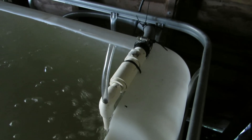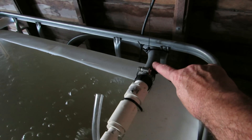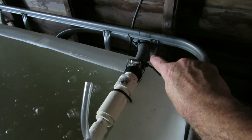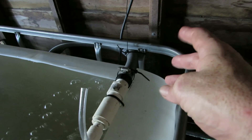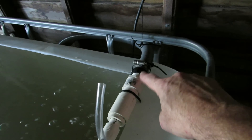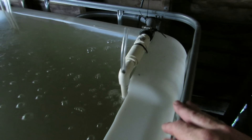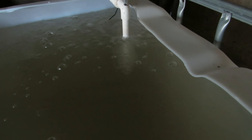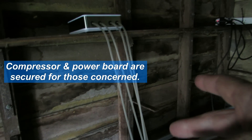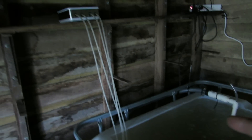The water is coming in through this little DIY venturi — some of you may recognize it from the fish farm. It's attached to some gray hose that Michael picked up at a local irrigation and rural supply store, normally used for moving water between water tanks. The guys there assured him it is fish friendly. Just into a nut and tail fitting, with a 316 stainless steel screw holding the assembly together. It's a very basic venturi and it's adding a fair bit of air into the system — going down around about 20 centimeters into the water.